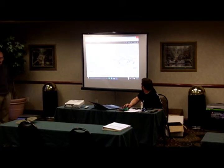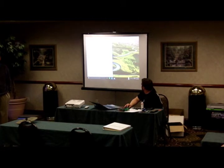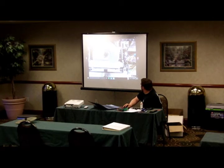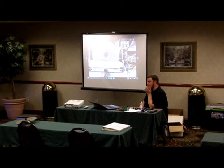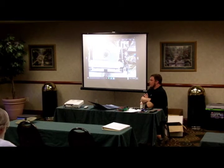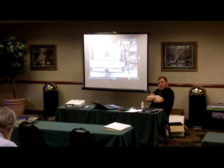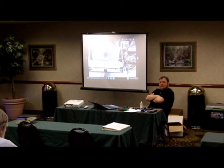What was the difference between designing it that way versus the JK players? I didn't even realize the FGs were direct drives. That belt just gets it up to speed, and then the magnets take over. I think they wanted a more advanced player, so they went to a crystal controlled oscillator that drove the turntable in the JK ones. This was also limited. It spun relative to 60 hertz, so as soon as they wanted to go international, they had a problem, so they made it electronically switchable.